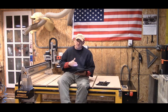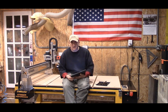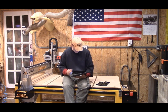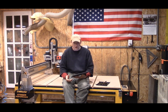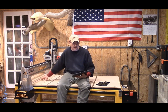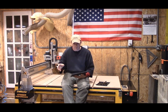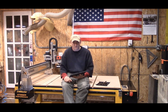The second CNC router is the CNC Shark. Rockler carries this, as does woodcraft.com. I'm not affiliated or associated with any of these places — this is where I found the product when I was looking into buying a machine. The unit is a little bit larger than the ShopBot. The Shark offers an extra 1.5 inches underneath the Z-axis travel, and an extra 6 inches of travel on the X-axis, so the space between the gantry is 24 inches instead of 18. The Y-axis movement for the Shark is identical to the ShopBot at 24 inches. So the Shark is 24 by 24 with 7 inches under the gantry, and the ShopBot is 24 by 18 with 5.5 under the gantry.